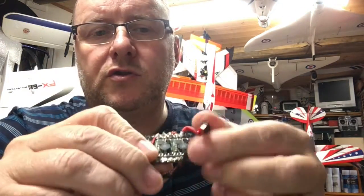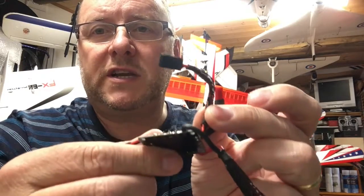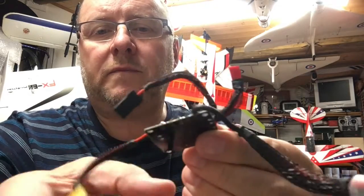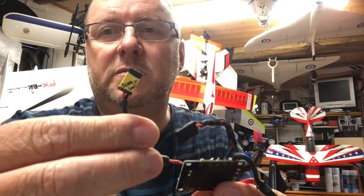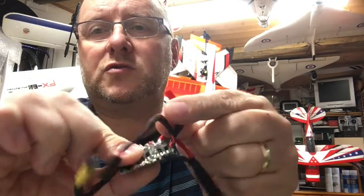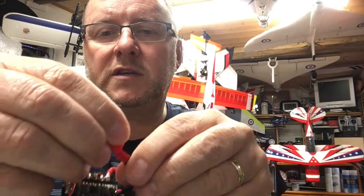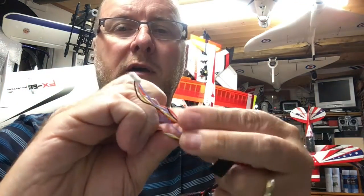If you've done your power distribution board, you should always allow a 12-volt out for your FPV — you don't need to do any more than that. I've got 5 volts going into my flight controller board, and I have a 12-volt output there. I've also got a VBAT connection there giving me the incoming battery voltage. So I've got 12 volts; when I come to do my FPV, all I do is plug that in and I've got power to the video transmitter. So I'm using the lead that I've made up, plugging it into there and that into the camera — and that should be it.